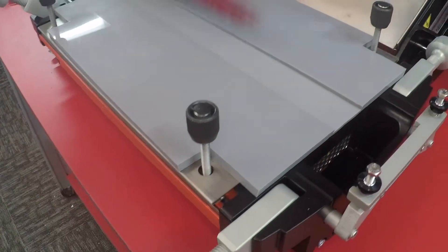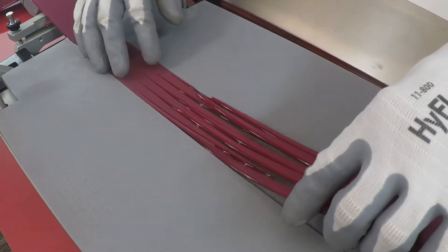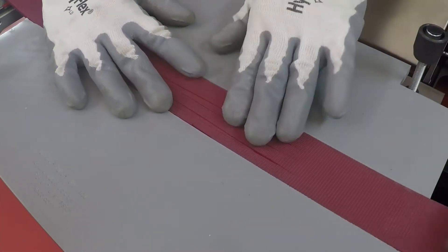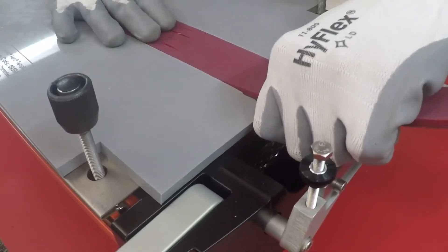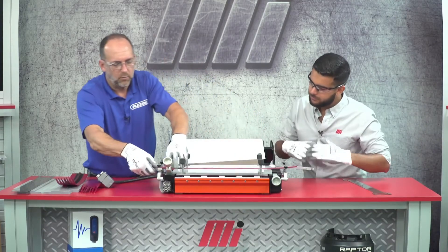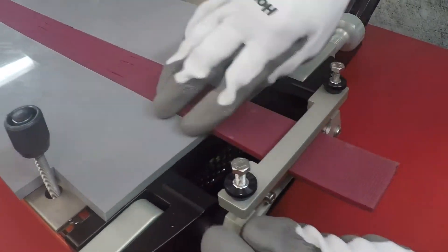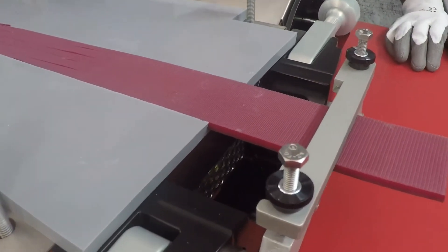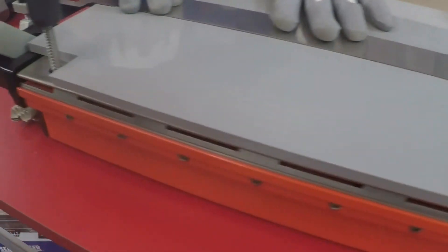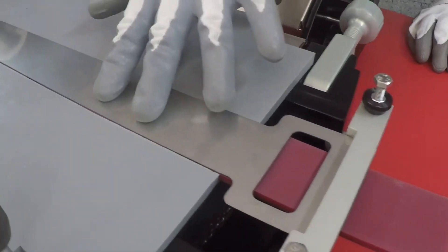You'll see how nicely they just fit together once we get them in here. I'm going to go ahead and put my first belt end in, just like so. Then I'm just going to bring my other belt end in so they mesh nice and tight in amongst each other. Once I get them lined up, I'm just going to push them in place. See how nicely those go together? Next step is take your end clamp and go ahead and lightly tighten that in place. Next step is going to be the pressure plate. We want to check the alignment of the pressure plate — it's important that it lies right over top of the belt itself. The purpose of the pressure plate is to make sure that during the splice process we get a nice even pressure across the entire length of the splice, and that's going to give you some really consistent results.